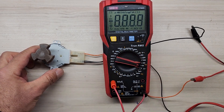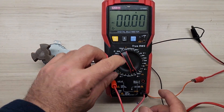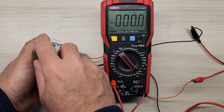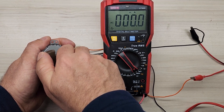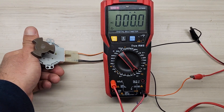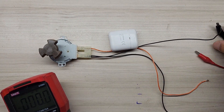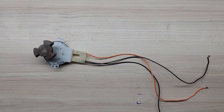Let's open our measuring instrument again. Let's set it to the 600 mA AC range. We'll now see how much current it produces in a closed circuit. Look — the motor produced 38 mA the moment we started spinning it. We saw 44 mA. Around 44 mA is the closed-circuit current this motor produces. Now let's see how many strip LEDs we can light with this motor.